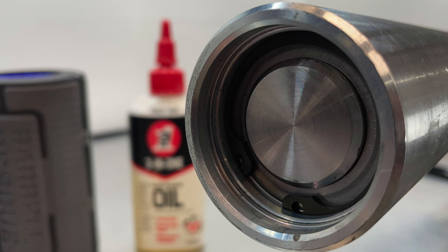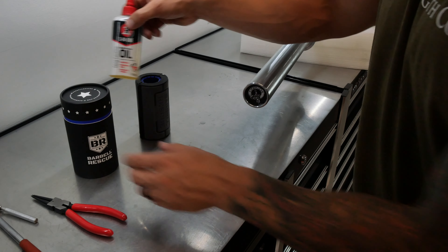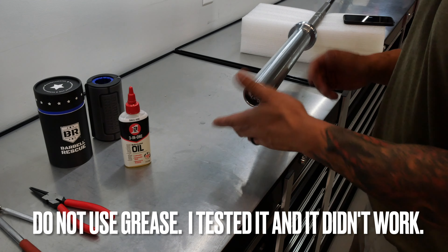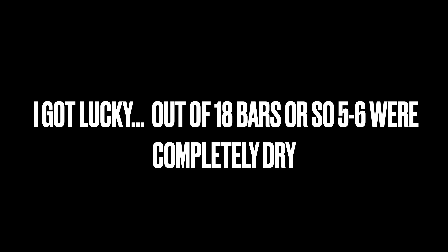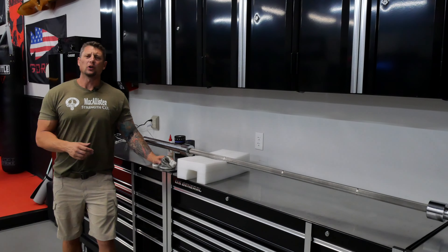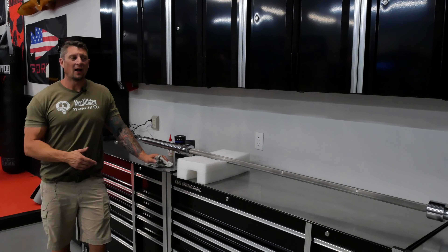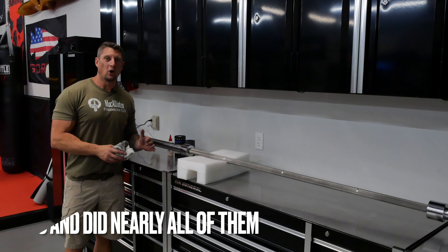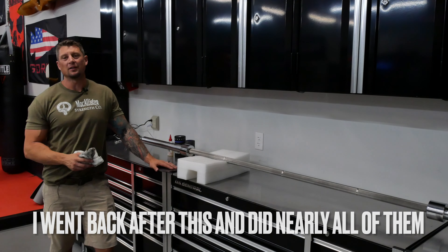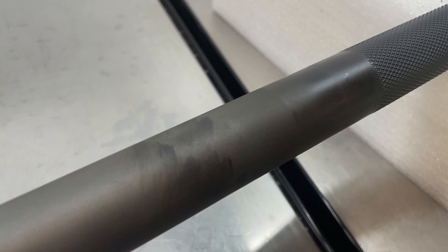If you've got time, take your barbell brush — I'm using one from Barbell Rescue, I love this brush — and grab the same 3-in-1 oil we used to lubricate the bushing, and clean off the knurling on your bar. That concludes the video. Something really easy — I wanted to do a quick tech video for everyone out there who hasn't seen this done so they're not scared of it. You can do this at home. You can get snap ring pliers at Harbor Freight — I recommend buying an entire set so you have all of them you need. The tools required are really simple: some 3-in-1 oil and snap ring pliers from Harbor Freight, and you can service your barbells.